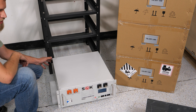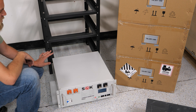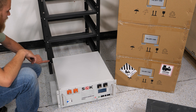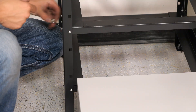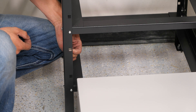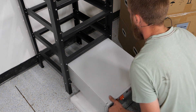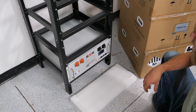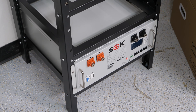Unfortunately the cart didn't go as low as I had hoped, so the bottom slot is a little bit of a pain. I almost screwed up, because I was about to slide this battery into the rack but I hadn't yet put the captive nuts into the rack to screw the battery into. This would have been a problem because you have to snap these in from behind, and if the battery is in there it blocks finger access for getting them in. So now with the captive nuts snapped in, I can slide the battery into the rack and get some screws to secure it in place. One down, three more to go.